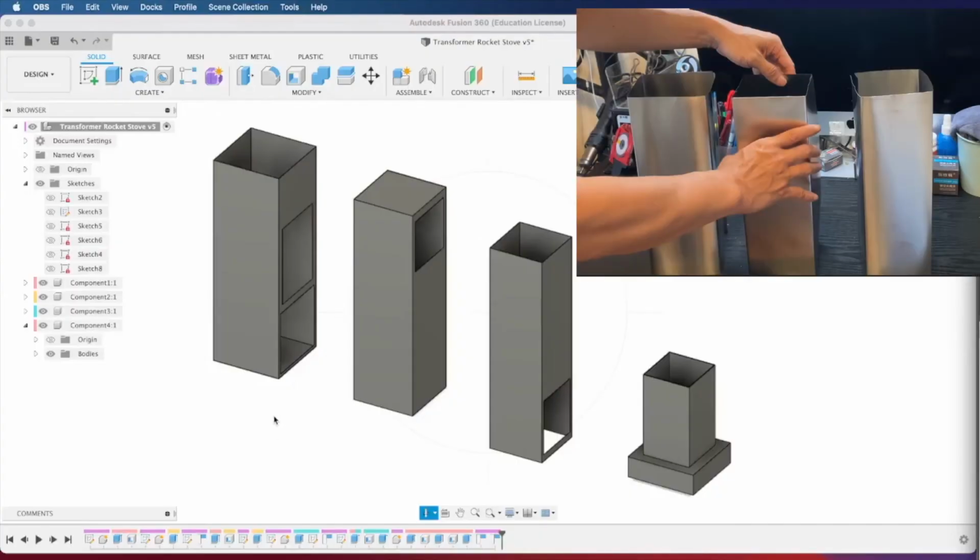This multi-purpose stove is made up of 4 pipes made of 0.2mm or 0.3mm stainless steel. So you buy the stainless steel sheet and then you can bend and create these pipes. I'll show you how later. The pipes measure 1 foot for the first 3 and the last one is half a foot. Each one of them has a different size.